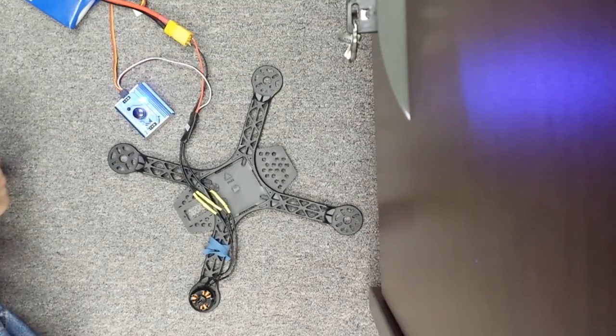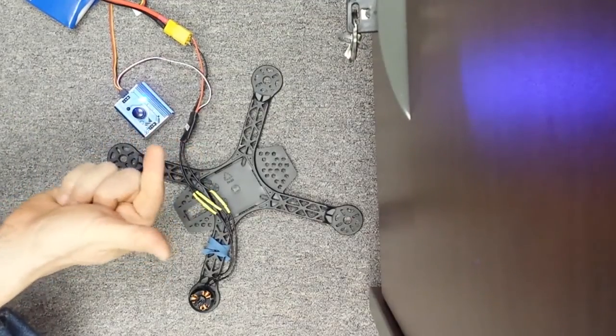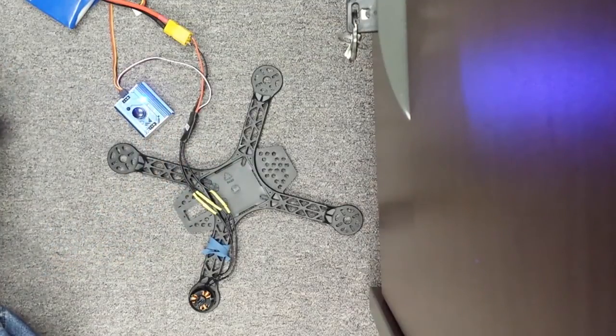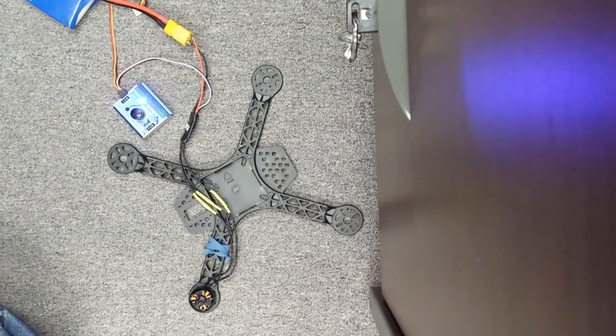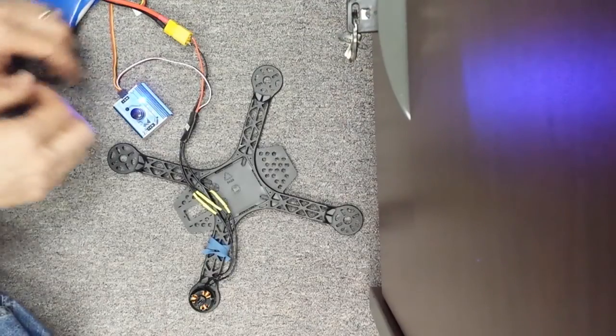I should be in 10-1. That's ten-two. Counting one through ten, then beep-beep. Now we're coming to ten-three, and ten-four is what I'm after. Next one — then you drop it to zero. It resets, and now you'll just be in regular motor mode. So we can put a prop on and test it.